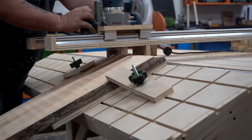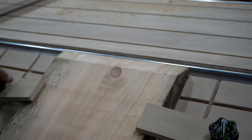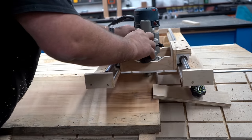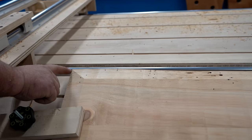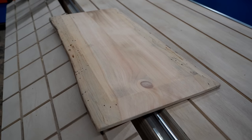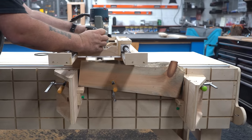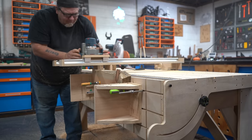Making the front adjustable so you can move it to different angles means we can do a lot of different cool things. One of the basic things we can do is create really severe chamfered edges on tabletops — we can get some really big long chamfered edges, or we can do something like about a 60-degree angle. Granted, you could probably pull that off on a table saw, with the exception that you can't chamfer a natural edge face — one that's got a lot of curves to it. With this, you can, and it's just as easy as doing a straight edge. Right now that router sled allows the router to come out with a 10-inch cutting capacity in front of the face, and I'm going to adjust that so it can get a little bigger — we'll show you that in an upcoming video.